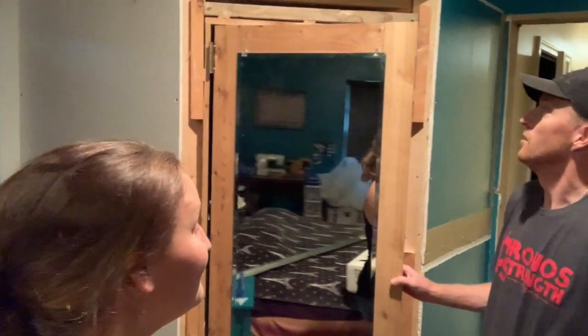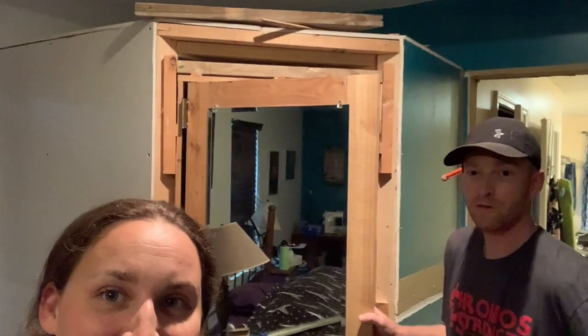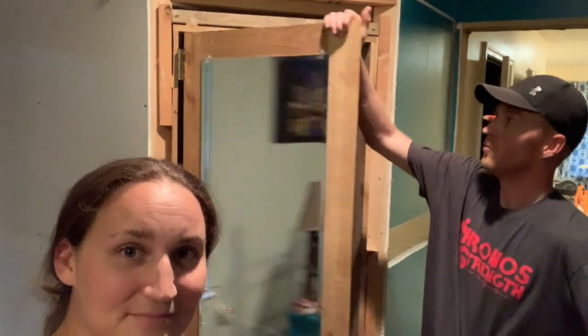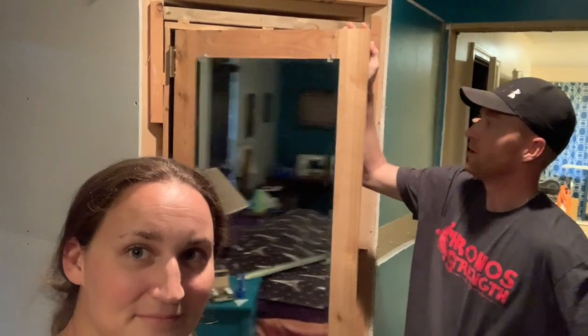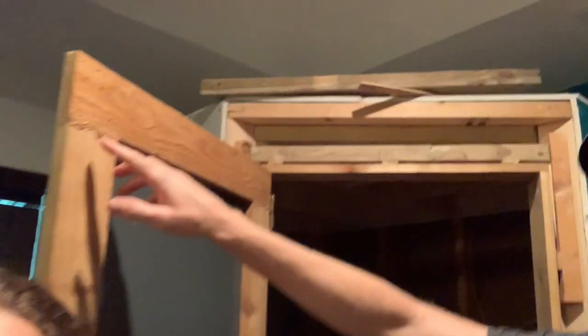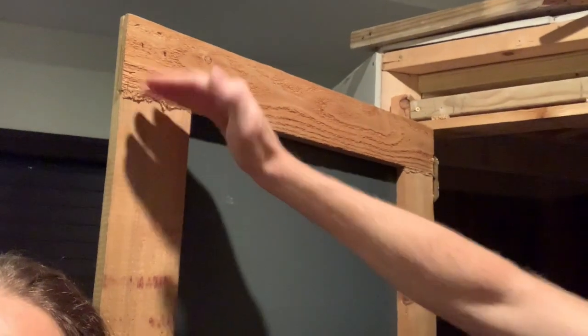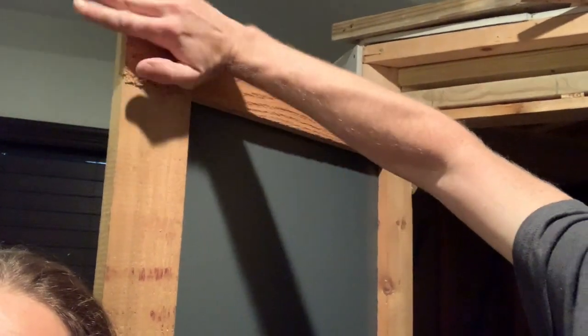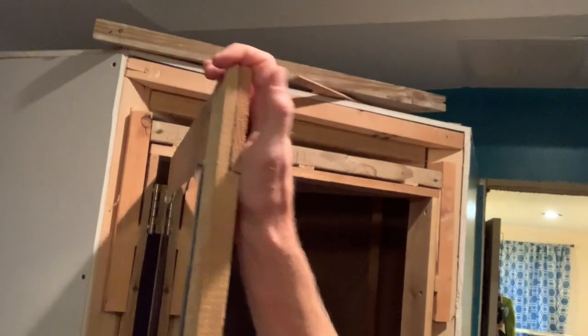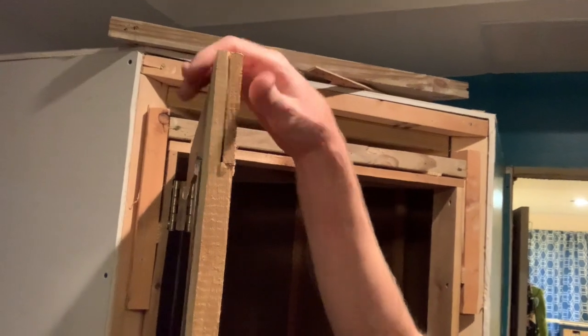Okay. All right. So if you look up sauna doors, they're about $500+ a piece. So we decided to build our own. So this is simply cedar 1x4s. And all it is, we did a lap joint. So if Becky will turn the camera, a lap joint. So all it is, you take a router and grind down this section and then grind down this section and they lap. And all that's being held is glue and staples.